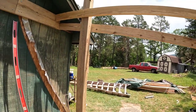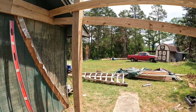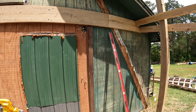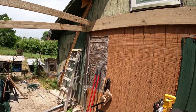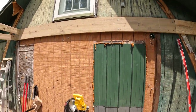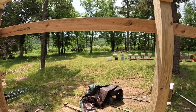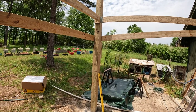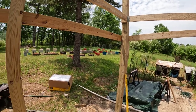So I'm gonna spend the rest of the day securing all these. Tomorrow the lumber will be here. The first thing we're gonna probably do is get this roof on, because I have to put all the joists up for the deck. Otherwise, I'm fighting, like I said before, getting inside all the roofing joists, and I don't want to do that. And I'm waiting on my joist hangers, which I can still go ahead and hang the joists up and just come back later and put them on. In fact, that's how you put them on anyway. I don't think I'm going to put any joist hangers on this end. Not necessary. I'll just nail through the board with my nail gun. And it's gonna go pretty quick now. I hope to have all this structure, the decking on, the roof on, by the end of next week if the weather holds out.